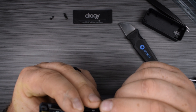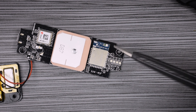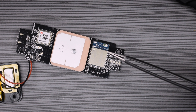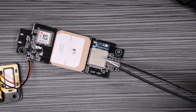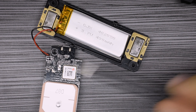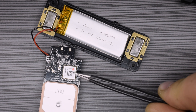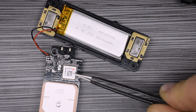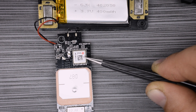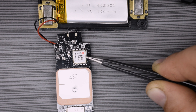Let me go ahead and get some information about this stuff. First, you have the Ehong EH-MC10 Bluetooth chip — it runs at 3.3 volts and has up to a 300 kilobytes per second data transfer rate. This is the module that's actually talking to your phone. This is a U-Blox Max M8Q GPS receiver, which is directly attached to this ceramic patch antenna. These go for about $20 to $25 depending on where you buy them. It operates at 1.575 gigahertz — or 1575 megahertz — which is a typical civilian GPS signal frequency.